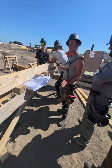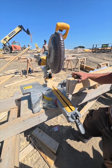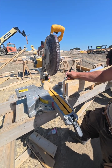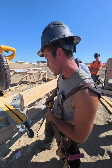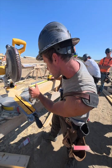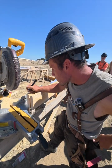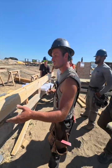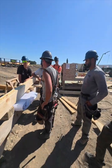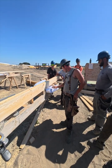Now what we have to do is I like to just go right here. You see there's an issue right here, not an issue, but we don't have room for another stud here on the end. So we got to fill in this space because you can't have that space on the edge of the wall. So I'll see what it is. It's exactly 3/4 of an inch. So let's go ahead and put some 3/4 ply there. That's just the flooring we get. Okay, that's good. Now I'll mark for the top plates.